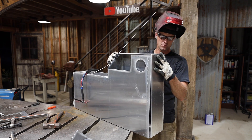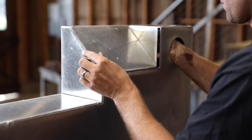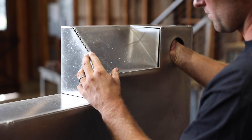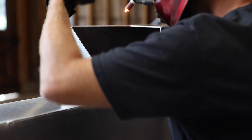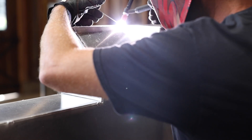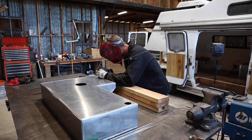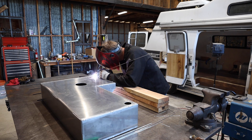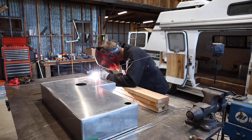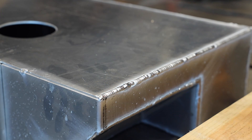I really wanted to use all the space I could for the tank, which meant it came out looking fairly intricate. In a van this small, you don't want to waste any space. I don't have a ton of experience welding aluminum, so I'm still figuring out the best settings. For aluminum you use alternating current power, which is why it makes a buzzing noise. When it's working well, it's really enjoyable — the aluminum gets glossy and almost mirror-like when it's molten, and you just dab, dab, dab with the filler rod as you travel across the weld.